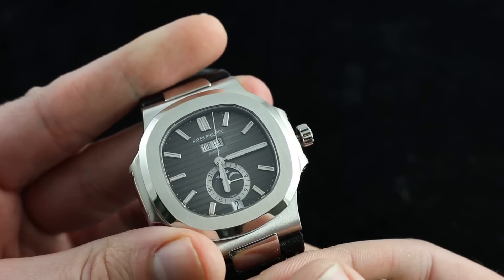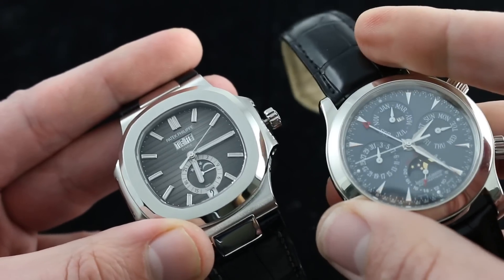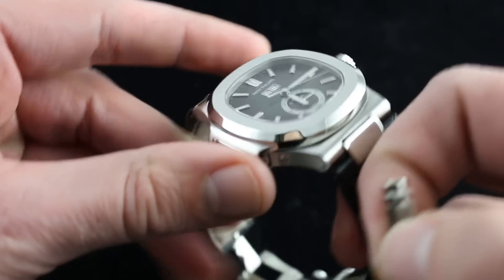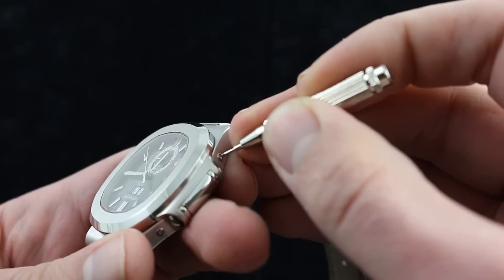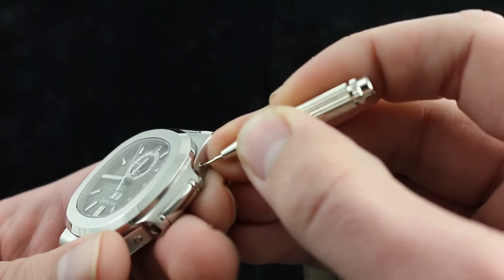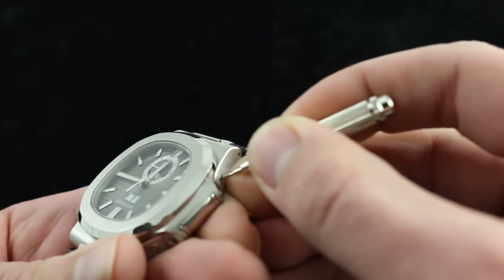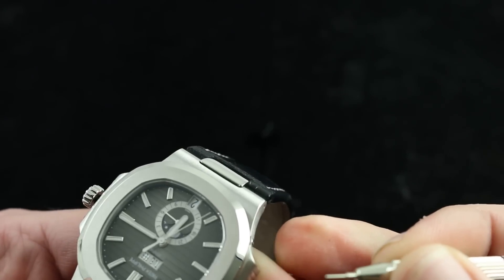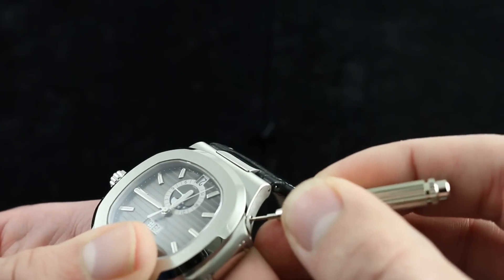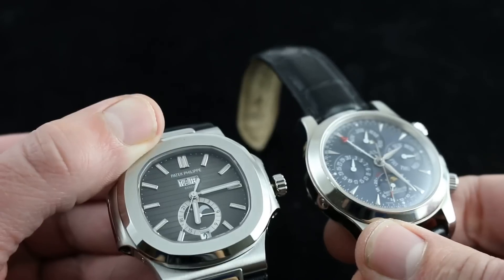And we have all of our indications. Now, for moon phase reference, I'm going to bring in a little bit of help from a friend of mine. I can see that it is a waning moon, but this one has advanced a little bit too far through the cycle. So I'm going to have to go around to the indication adjuster on the case flank located right here at 8 o'clock. Interface with the pusher, and keep in mind that a moon phase being 29 and a half days, there are going to be quite a few jumps here. Each day of the cycle rotates the calendar indication — you can see how the moon is advancing underneath the hour hand. And perfect — I have just enough of the waning moon to match up with my reference.